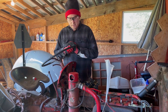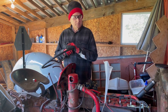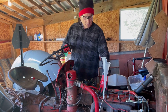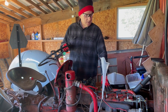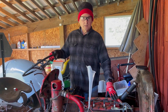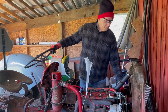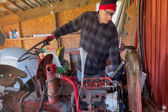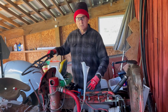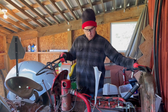We're going to try starting the tractor again. I tried it this morning and it would crank but it wouldn't start. I did some troubleshooting with a test light to see if there was spark to the spark plugs — there wasn't. I also put a test light on the coil and it wasn't making contact to ground, so I determined it was something with the distributor. I removed the distributor, which is kind of a hassle because it's front-mounted and very hard to get to. In later models they moved the distributor to the side so you can get at it more easily. A lot of the online videos about doing this conversion say to try it with the hood off.